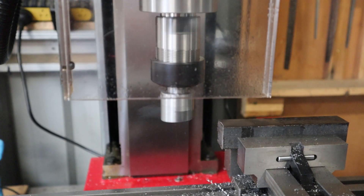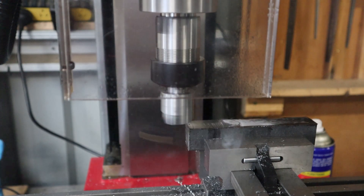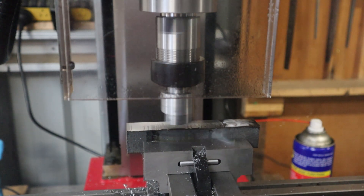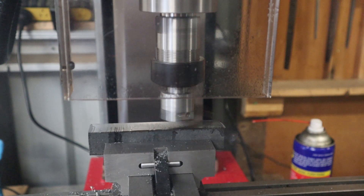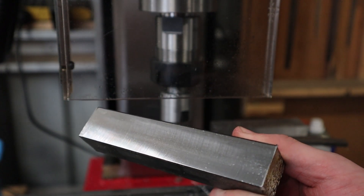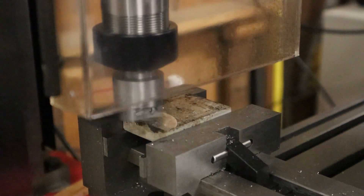Let's test it out. I loaded in some scrap steel blocks that had some mill scale on them. Depth of cut is about 0.2mm and the RPM is about 850. I'm feeding the piece through really slowly just so I don't break the insert. That surface finish is absolutely spectacular — really smooth and flat. Let's try some aluminium. I found an aluminium block at the tip and it's pretty dirty and beaten up, but a couple of runs through the fly cutter makes the block come out looking better than new.